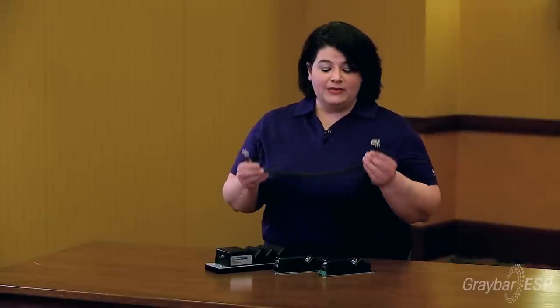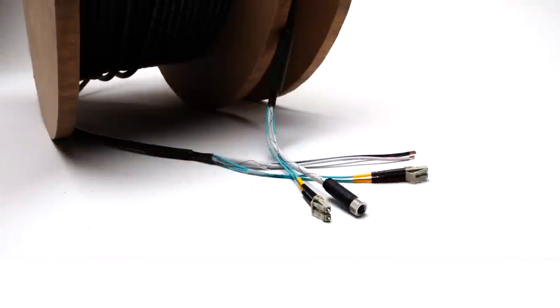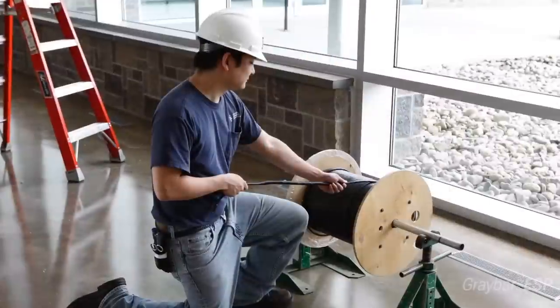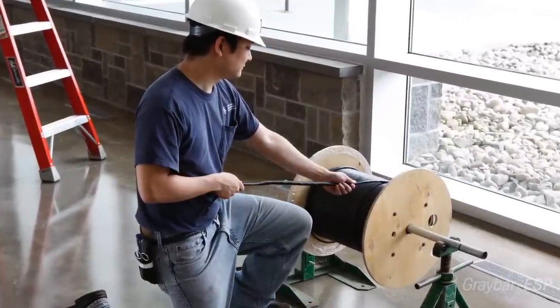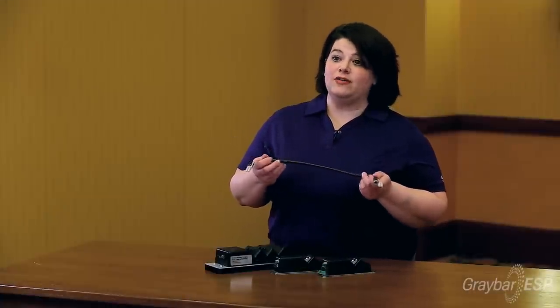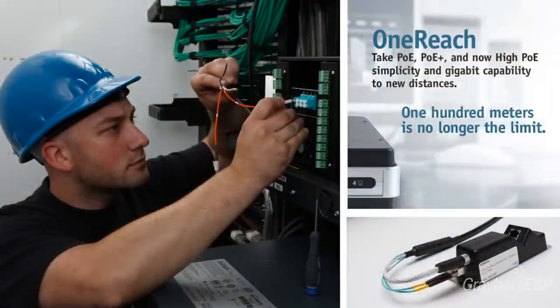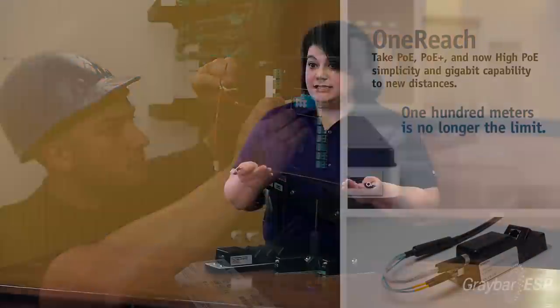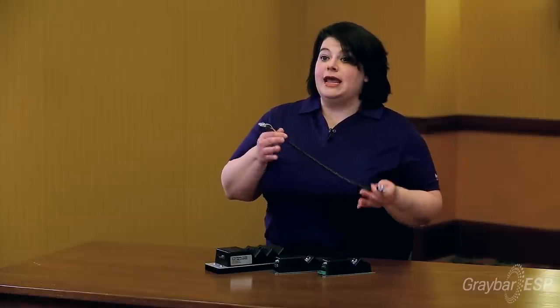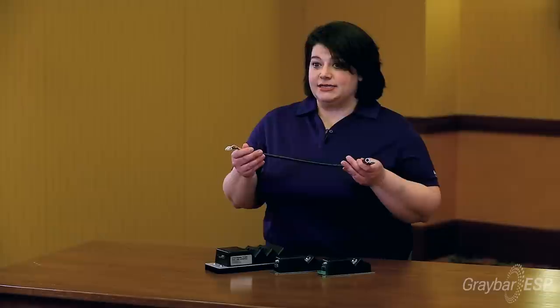The second component of the OneReach system would be the OneReach cable assembly, and this is really where the beauty is. We combine optical fiber along with stranded copper conductors in a single pull of CL3-rated cable. It's available in both plenum and riser constructions, which means if you have a wireless access point located in a plenum space, this is an appropriate product to supply both the power and the data connection to the device.